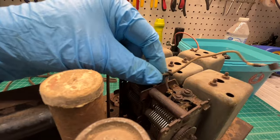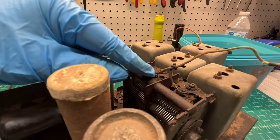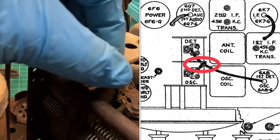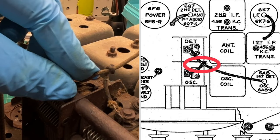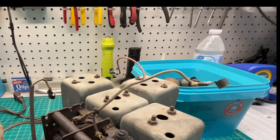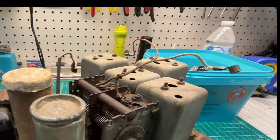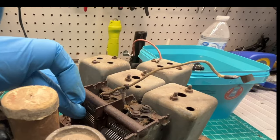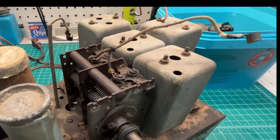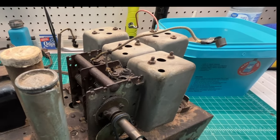One thing I want to be mindful of is to make sure I get this back correctly, so just a little visual documentation from the antenna and oscillator section of the tuning condenser. You can see the gimmick capacitor where we've got the conductor wrapped around about a turn and a half of the lead going back over to the grid of the 6A8. I've parked the tuning condenser fully closed so I don't bend any of the plates.